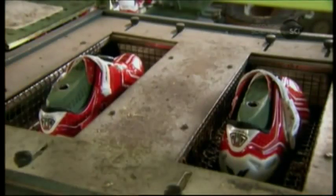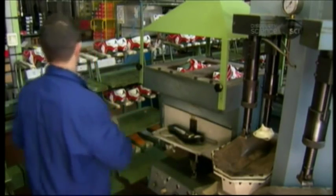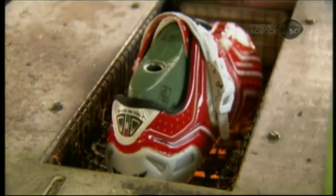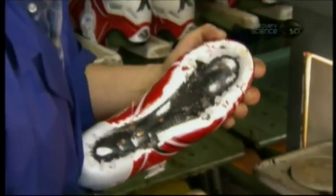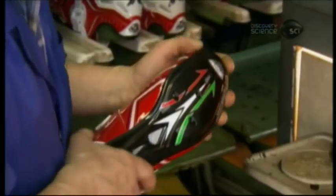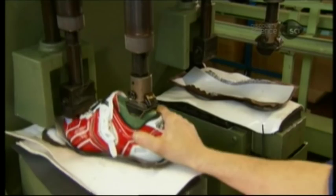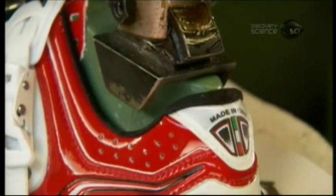After an application of epoxy, the shoe upper goes into the oven. At the same time, he heats the glue-covered outer sole in another oven — the heat activates the epoxy. It's time to join the outer sole and the shoe upper. He carefully aligns them and presses them together, then sets the shoe on a cradle where hydraulic pushers apply pressure as the glue sets.